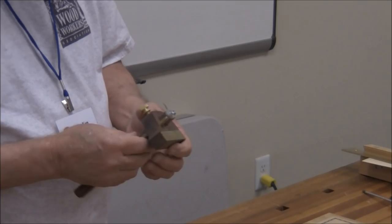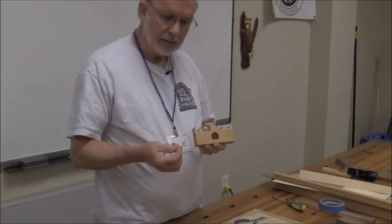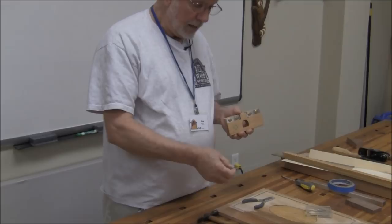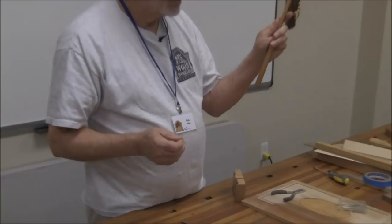That's why I'd say you have to have this. Let me explain why. If you get a sheet of holly — supposedly 1/32nd of an inch — and you scratch in your inlay so you can put the holly into it, put the glue in, and start putting it in, all of a sudden you've got a big fat place right there that you can't even feel. Sometimes you can tap it in with a little hammer, but most of the time you have to pull it back out, which leads to problems because you get some swelling from the glue.